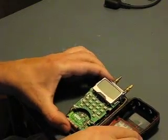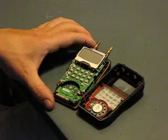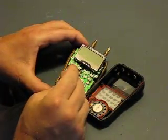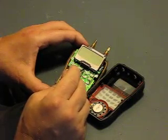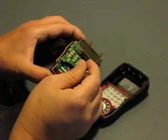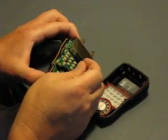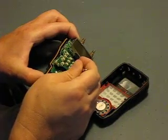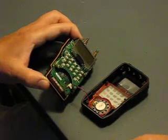The mod to extend the transmit-receive involves removing or snipping this blue wire jumper right here. You could just snip it and separate it — that will work. It's held on the board by a couple of solder pads right here. I'm actually going to remove it from here altogether, since it's easy enough to put a new jumper on there if I want to do that.